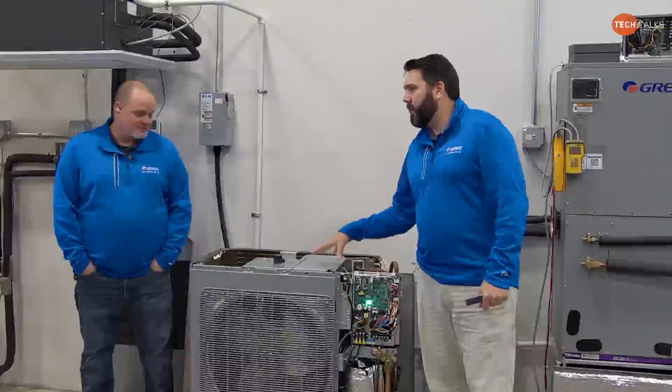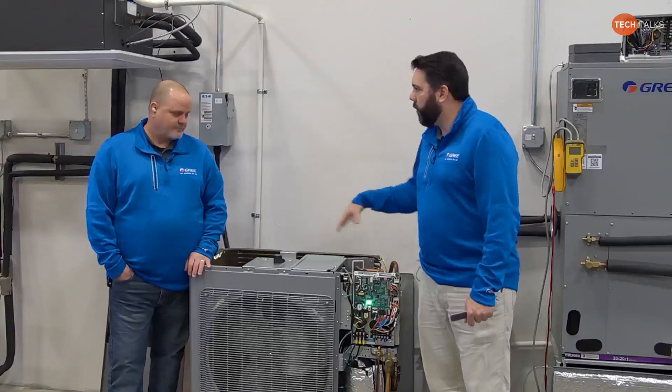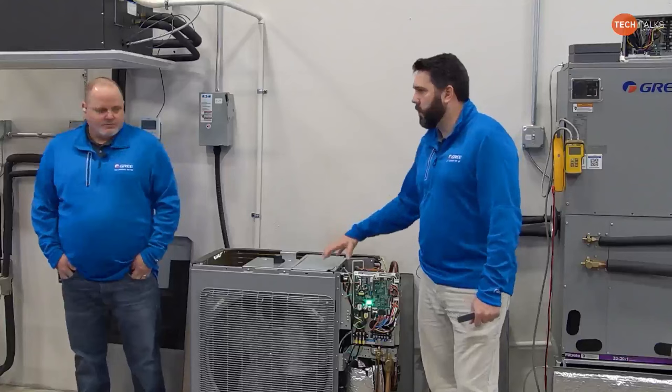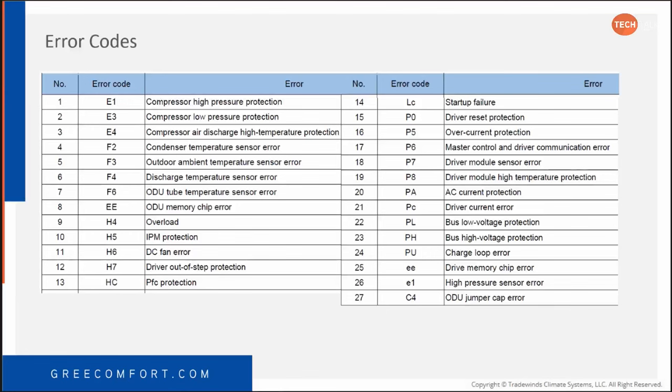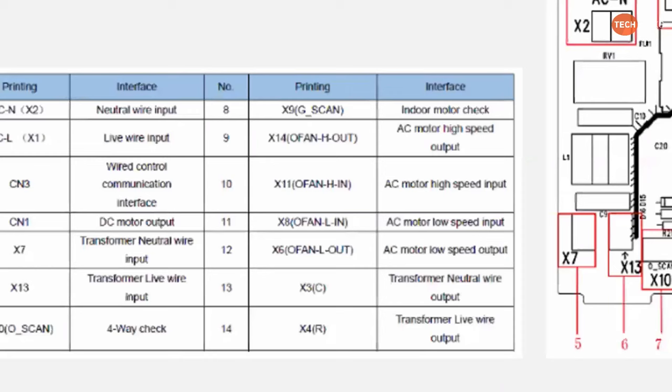So there isn't one. When I see an H4, I'm not thinking about compressor temperature. I'm thinking about inability to expel heat. That's what comes up in my head: I'm looking for why can't I pump heat properly. I'm creating heat because it's a heat pump. Why am I not expelling it? So then that leads me towards the indoor. Same thing as an H5 basically. I'm overworking the compressor and I'm unable to expel whatever heat I'm trying to get rid of.